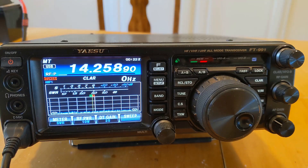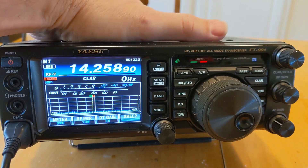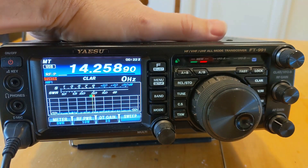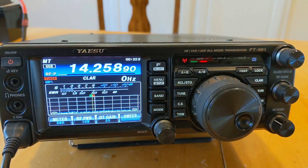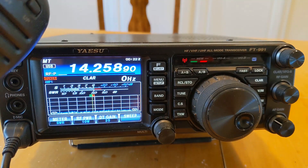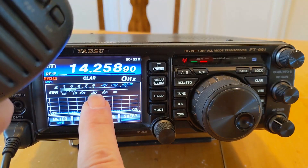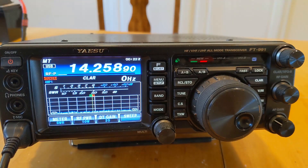Here's the scenario: you're doing a Summits on the Air, you've got your Yaesu 991, all hooked up, antenna's good, it's resonant. You're going to be on 20 meters today, so let's tune up the antenna by pressing this. You can see it's tuning up — this is the SWR meter right here, less is always better. It looks like it got SWR of 1 to 1, fantastic, ready to rock. This is KM6LYW radio testing — no, it didn't tune, even though it looked like it did. We've got some bad ground references inside, and it affects a lot of them.